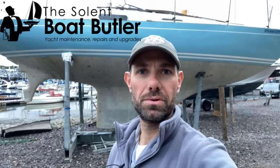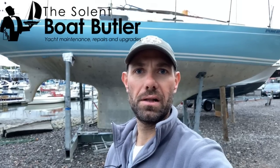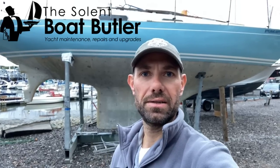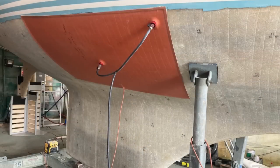In an earlier video, you would have seen me peeling the hull and removing seacocks, rudder, stern tube, etc. And I've been going through a lot of washing out here in the open. So that's helped dry the boat out a little bit. And the next stage is to get her under cover when I can apply my heat and vacuum pads and get her properly dry. And then if you keep watching, you'll see me rebuilding the surface of the underwater hull and getting her ready to go back in the water.